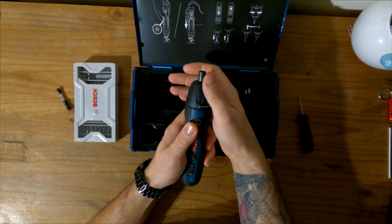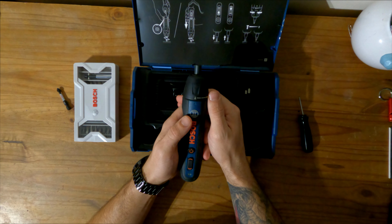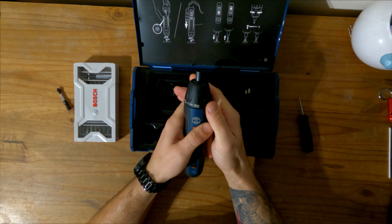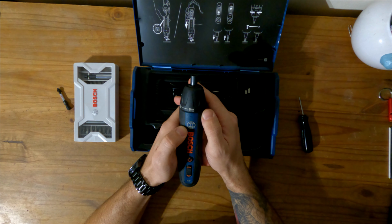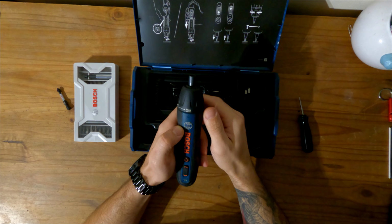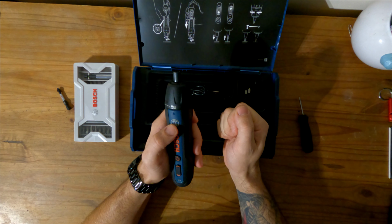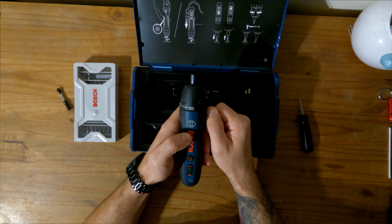However, if we're looking at bolts and you want to put an attachment on the end, say 10, 13 mil, because you're not really going to go any higher than that on these. The torque will take a 13 mil bolt in, depending on the torque requirements of the unit that you're trying to screw into; it will be acceptable up to 10 mil, 13 mil. So if you're doing bonding, if you want to do a ring crimp with a 6 mil bond, and you want to put a brass nut, bolt and washer together, you hold a spanner on one end, put this on max and screw them together, fine, excellent. The tightness is great, it's no problem there, it'll pass continuity, etc., no drama.